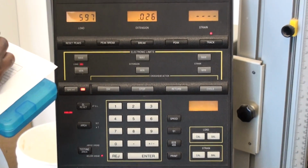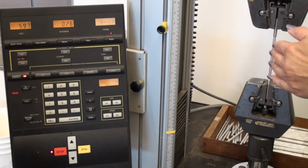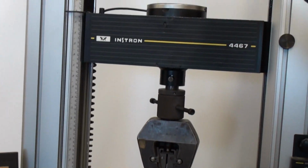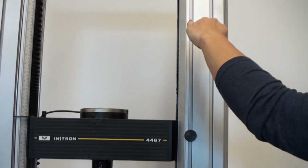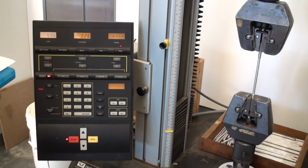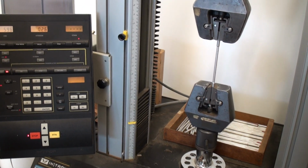And as we make our stress-strain curve, if we think about what we saw in class, it goes up very, very quickly, in that it increases at a decreasing rate, and it will level off, and then it'll drop slightly, and then the part will break. And we will see that here. So for the first 3 or 4 pulls, it's going to increase very, very fast.